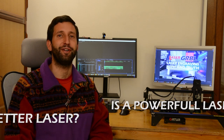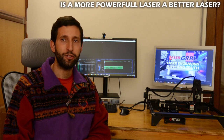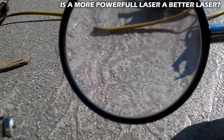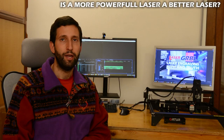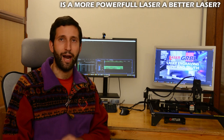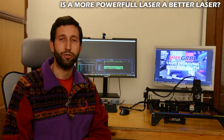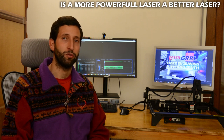Is a more powerful laser a better laser? The way a laser engraver works is by concentrating light into a really small dot — a little like when you use a magnifying lens with the sun. The smaller the dot, the more powerful the engraving. A laser diode without a focusing lens would not produce a point by its nature; it would make a bar. The higher the laser power, the wider that bar becomes. In technical terms, we call this issue divergence. This means that high-power laser diodes are more difficult to focus into a spot.